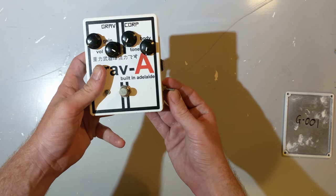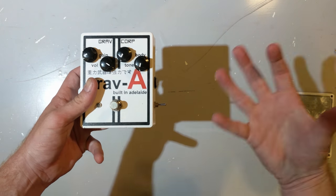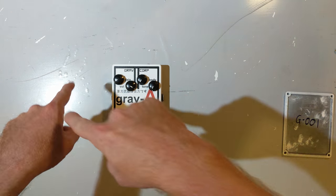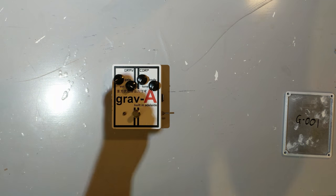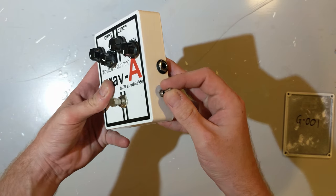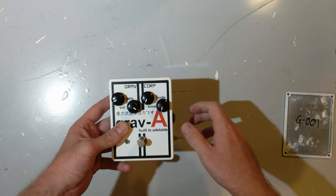You can flip it into one of these two modes, top or bottom, and that switches some diodes into the circuit. What those diodes do is they take the AC waveform and they basically clip it to ground and make it all fuzzy and delicious and sound amazing and aggressive and sometimes painful. Those are selectable, the different clipping modes with this switch. I'll talk more about that later.